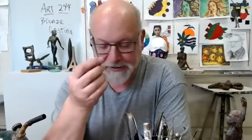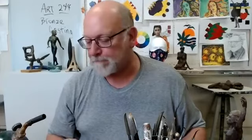It's an X-Acto knife. So if you have to be a crafty person and have X-Acto knives, they come in really handy for cutting the wax and for doing other cutting things that you need to do with the wax during the sculpting process when we are working in the brown microcrystalline wax. I can't give you knives, but if you can come up with an X-Acto knife, a snap blade knife, or this kind of full-size craft knife, that's really handy for cutting the wax. Otherwise, just using the needle tool and tracing over and over and deeper through your lines will eventually cut through the 1/4 inch thick piece of wax. So you can just use the needle tool to draw your wax pattern on and then cut away the excess wax from your pattern that you're working on. So I'm going to divvy this stuff up and give it out to you.